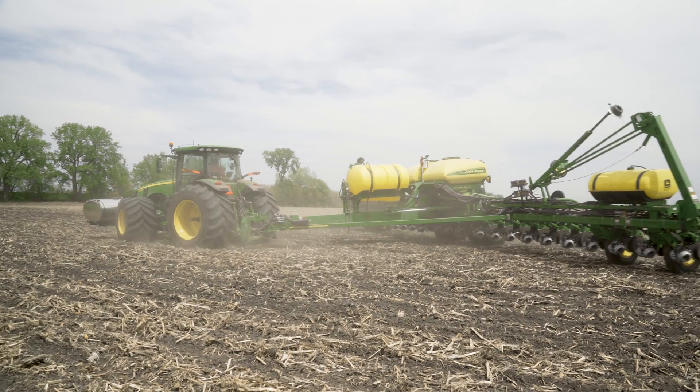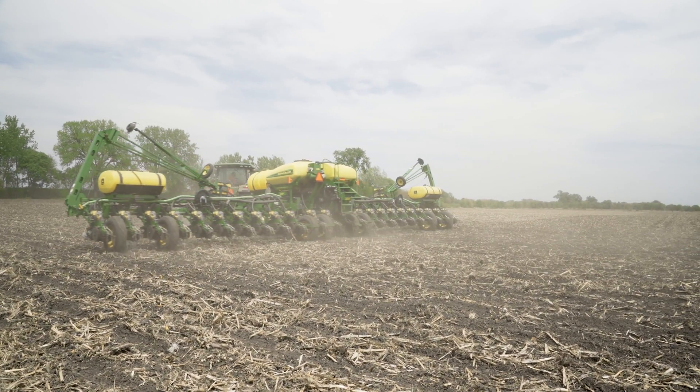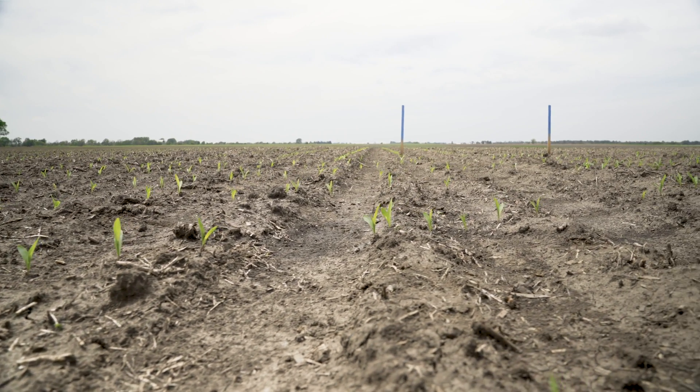This year it's been more really mellow soils and this tractor with the LSWs on it stays on top versus making any kind of footprint at all. If you get it onto a bigger footprint, it's going to stay on the surface better — you're not going to have the tracks and you're not going to have the damage for the following year.